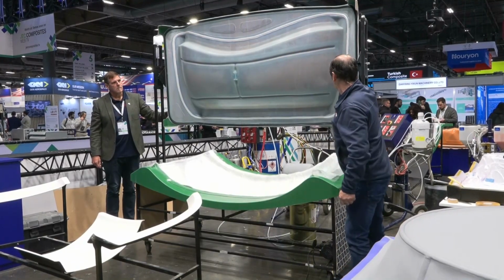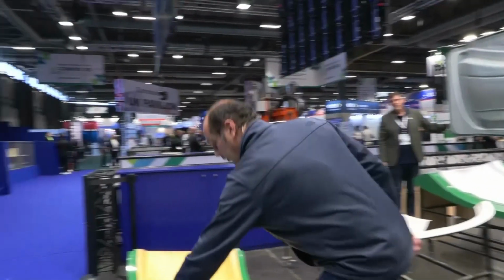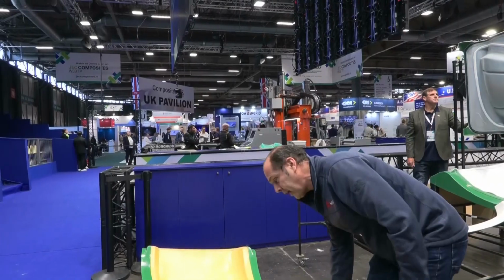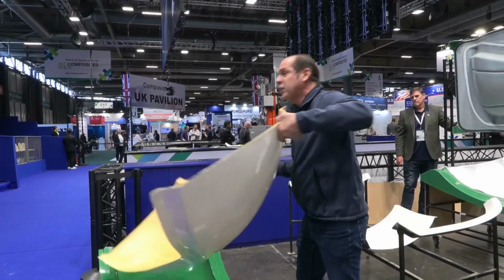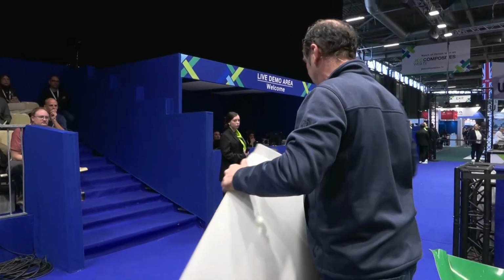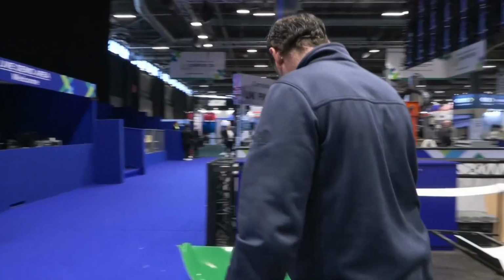Then the silicone will touch the surface. I design my mold to be sure that people will know exactly where to stop the glass. So then, when I demold the part, I demold a finished part that doesn't need to be trimmed. I just grind a little bit here, and it's done. That's it. And my mold is clean.